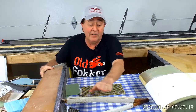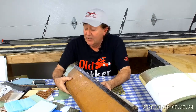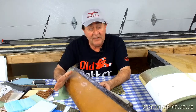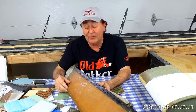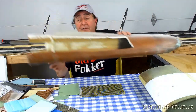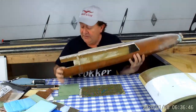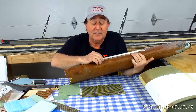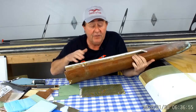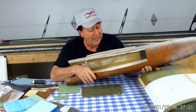That design had a 40-foot wingspan, about 160 square feet of area. It was a fiberglass and carbon fiber composite D-tube with ribs that unfolded, then had Dacron fabric covering behind. That aircraft — 40-foot wingspan — weighed 85 pounds. I was shooting for 80 and hit 85, so not too bad. In aircraft design you usually plan on going 10 or 15 percent over, but I managed to stay well within that. There were some very unique things I had to do — turning it over, you can see on the inside this is just a shell of fiberglass, 120-style at about 3 oz per square yard.